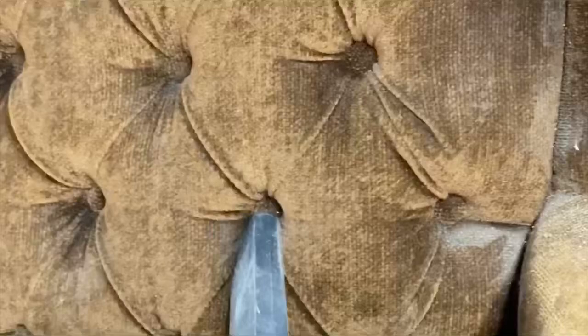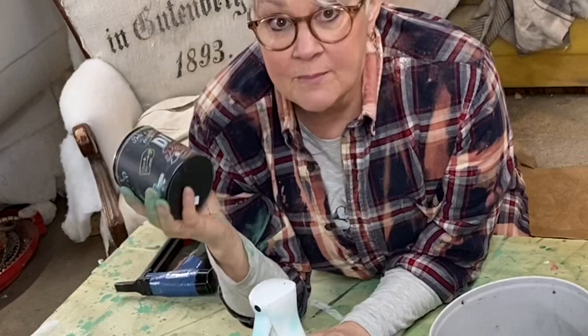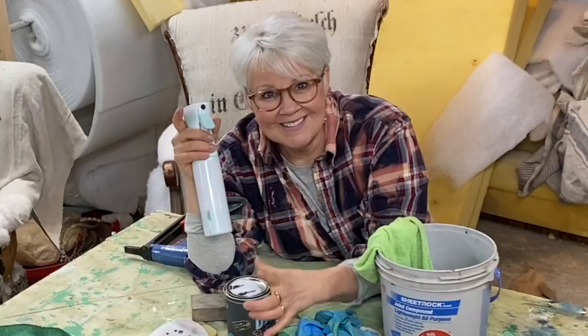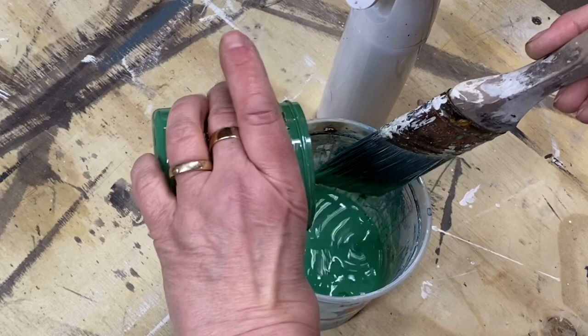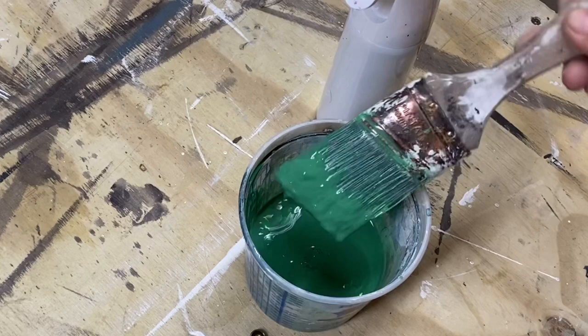The first thing I wanted to do was give this chair a very good cleaning. It had been sitting in my basement for two years, so it was pretty dusty — get in all those cracks and crevices and make sure it's good and clean. Then gather your supplies: some Debbie's DIY clay and chalk-based paint, some gloves and a brush, some sanding blocks, and some water. I made a thin, watery solution — about one part paint to two parts water. I chose Debbie's DIY Salty Kiss as my color to get that deeper emerald green I was looking for.